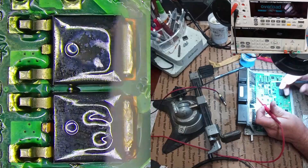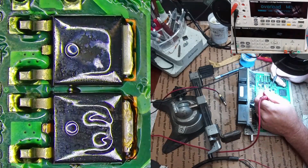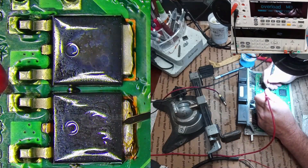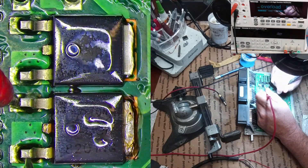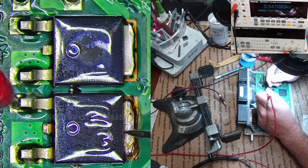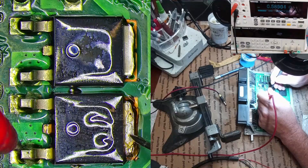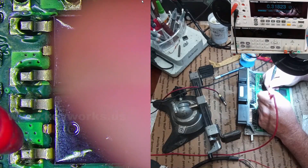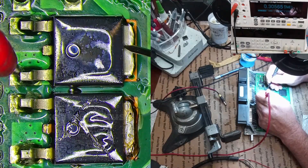I was wrong — it's not 2K, it's about 640, so very very low. It's definitely bad. And checking the emitter and collector, there's only 32 ohms of resistance between them, so it would always be on — it's shorted closed. The good ones are reading 305, 280, 280, 280 — so we have a bunch of 280s on this side.